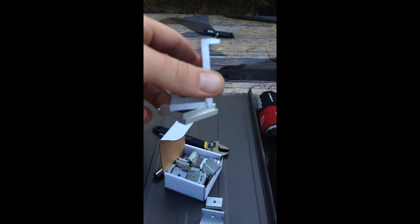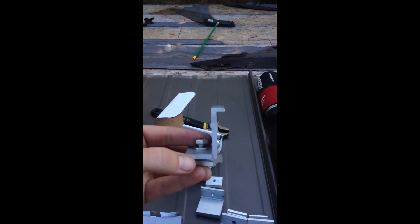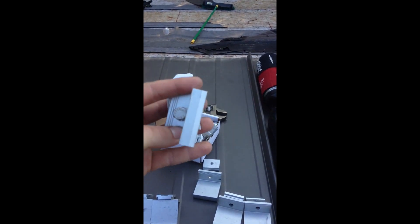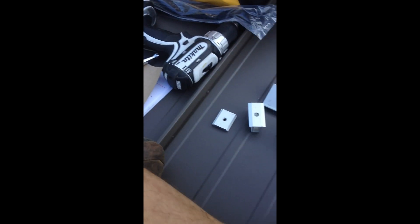Here are the Pro Solar rack mounting ends. These pieces slip between the rail, twist, and then tighten down. They clamp the panel right here and hold it down onto the rail — there are two of them. And then in between the rails, the same piece goes underneath, but we do a sandwich piece, which has a slightly longer bolt that goes with it under these guys.